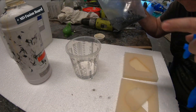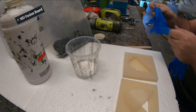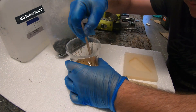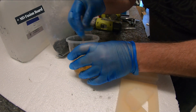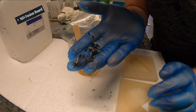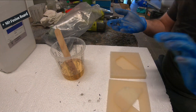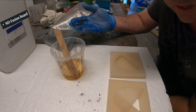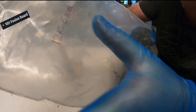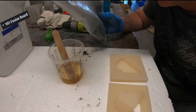We've got the resin in here, I'll put the hardener in, and we've got some carbon chop. So hardener in, give that a mix — really important to mix this up really well. This carbon chop here, we're going to put that into the hardener mix, put it into the mold, compress the other end, let it go off, and we're left with a forged carbon part. This is actually 12k, 5mil — so 12,000 filaments per strand of carbon.